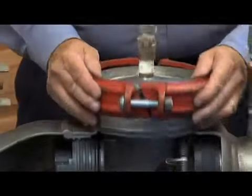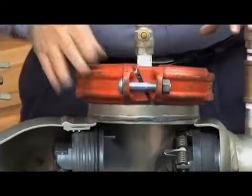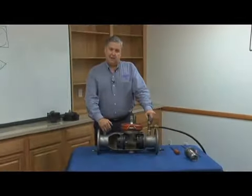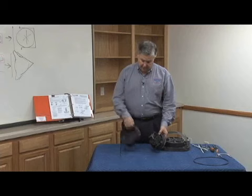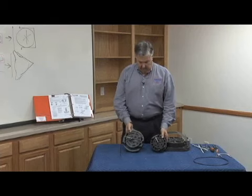So on that check cover like that. Again, relief valve sensing line, I took that off so you can see the cover. That's the 4000 SS in the 2.5 through 6 inch size. As I said, on the SS design, here's the 2.5 through 4 inch, here's the 6 inch check. Basically same construction technique, just a larger check assembly, again O-ring seal.